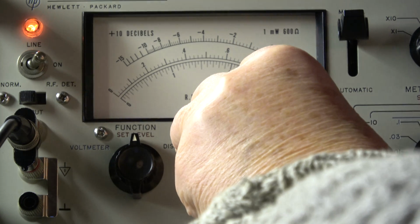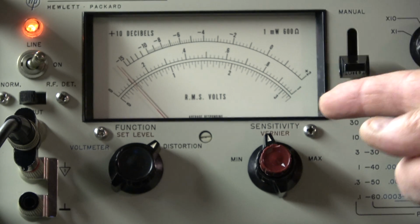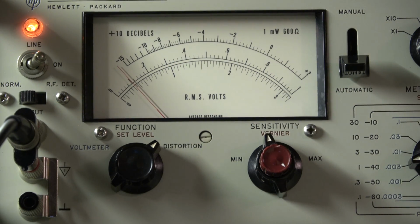Let's set the level to 100%. Distortion measurement. 1% full scale. Okay, we are again in the range of 0.1% at 12 watt. Well, I checked the right channel also, but I think it will have the same results. So we can say in low output power, 10 volt RMS, we have a very good THD, less than 0.1%. In the higher ranges, due to the crossover distortion, we have, of course, a bad THD.